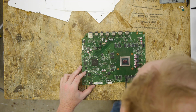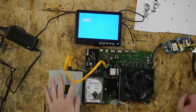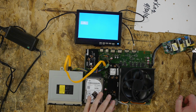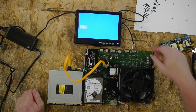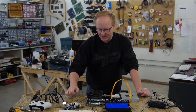It looks pretty good. I've put together everything on the Xbox One. So we have the Blu-ray drive. I've extended its power cable. I have moved the hard drive. I've put the front panel PCB at a right angle and ported out the buttons eject, bind, and power. I've moved the Wi-Fi module to a 90-degree angle, and I'm using the new short HDMI cable. Still got the original fan and the original power supply for now.